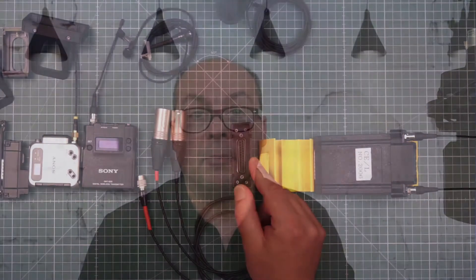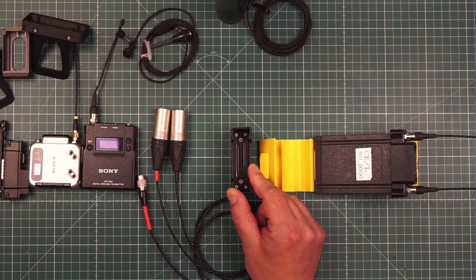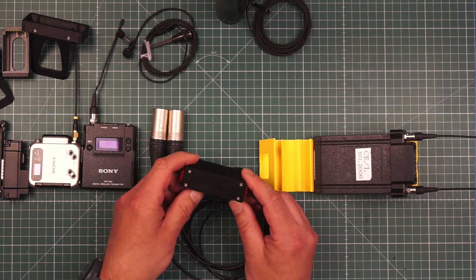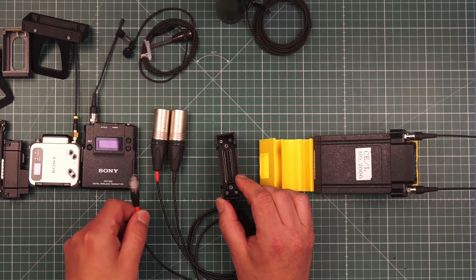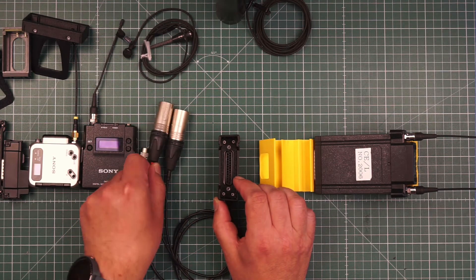Let's have a look at how I power the SO3D with the 25-pin adapter. The two adapters Sony has — the DWA-F01D and the DWR-01D — are only equipped with the 15-pin connector. So if you like to use the 25-pin adapter, you need something like this. This is a very simple product from HL-Audio in Berlin: the DWA-30P25. The link will be in the description. It has a Hirose connector for power, between 6 and 18 volts, and two XLRs for analog and digital output. Hardware setup is done.